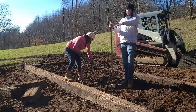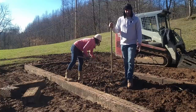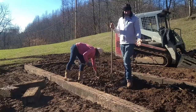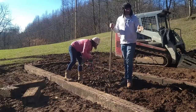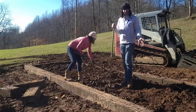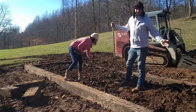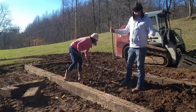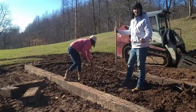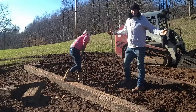We're at a similar height with the barn here and this is all sand pretty much. What I'm trying to get at is I don't think any drains on the inside or any sort of vapor barrier is necessary because of the soil type and what I've seen over there. This is just our wet season. So we're gonna put the dirt down, then add about 3 inches of gravel on top of that. That will be the floor to the solar kiln, and then we're gonna start our framing.